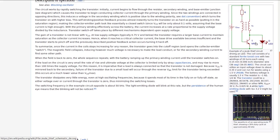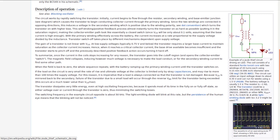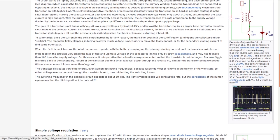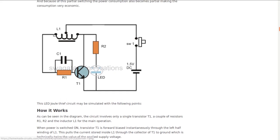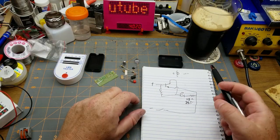Basically you're setting up an inductive coupling here — one side charges and discharges, the transistor turns on and off, dumping the magnetic flux out as current which goes through and lights up the LED. It's going to oscillate in a very spiky kind of way. All LEDs running off AC-type power flicker — it's just going to flicker so fast you can't see it; maybe the camera will pick it up. The inductor on mine isn't center-tapped like the common version, so I'll have to draw it out.